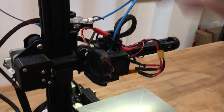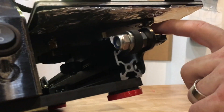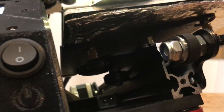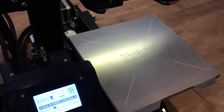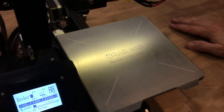I've also added yellow better springs — these are the flat section springs which really provide a lot more compression than the standard ones. I've insulated the bottom of my heat bed with aluminum metal foil and insulating foam. Those springs really help to keep it from vibrating when it's printing, keep it nice and tight so you don't have any vibrations, and keep your level longer.